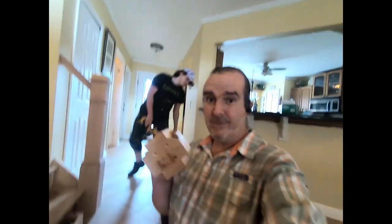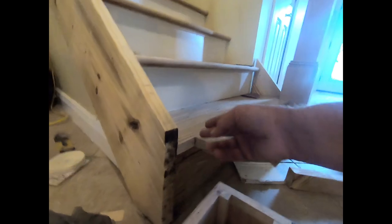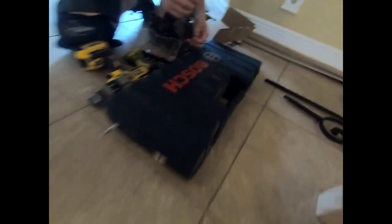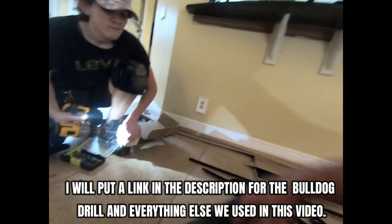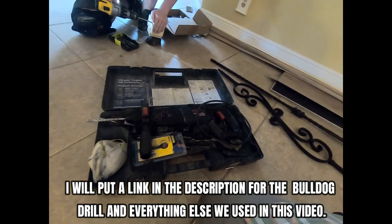When we deal with these posts, they come with really cool mounting blocks. The block goes to the floor — we tap on it, and we actually got some concrete bolts. Then the post sits over that, and you can screw your post to the mounting block, and also screw it into the step. The mounting block gives us a really good foundation. To do that, we've got our Bosch Bulldog hammer drill slash chipping hammer — it's an all-in-one tool. I have bigger chipping hammers, but this one is pretty handy. It gets into tight spots, and it's pretty inexpensive — under 200 bucks for a drill and chipping hammer in one.